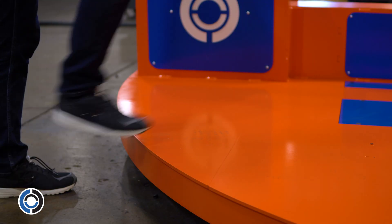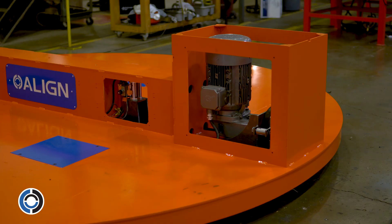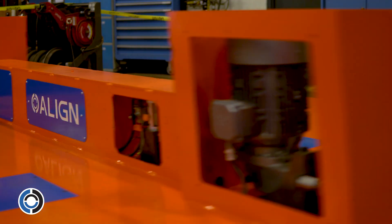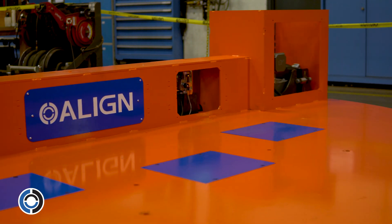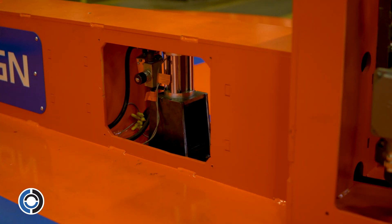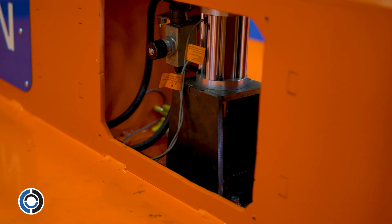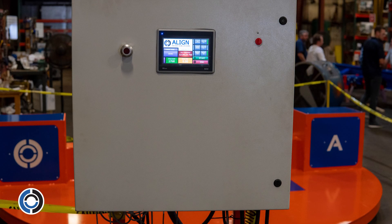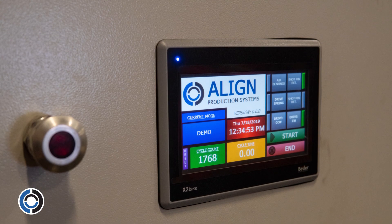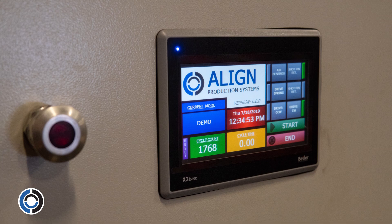The tables are only eight and a half inches high. Two electric drives in the center of the table provide the force required to rotate 180 degrees in approximately seven seconds. An internal shot pin provides guaranteed repeatability accurate to plus or minus a sixteenth of an inch. The control enclosure with HMI, VFD, and PLC is ready for standalone use or for integration into a larger system.